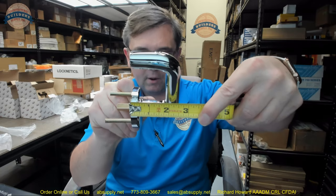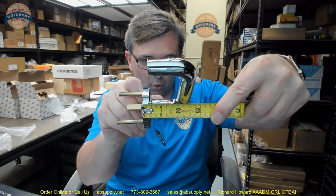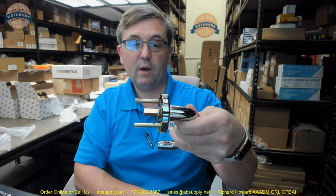So I would very much recommend that you review that. Projection of the handle — the distance from the handle from the edge of the door — is going to be a half of an inch. That would be no more than half of an inch, which is required by ADA, that it return to within a half of an inch. I would say that would be accurate.